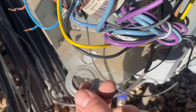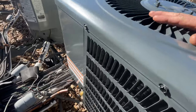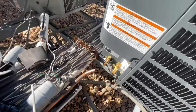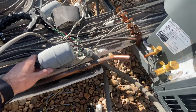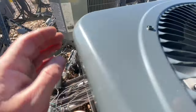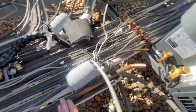Save these rings — they come in handy. Here's our drop-in condenser, this is a Goodman. I recommended replacing the compressor, but now look what we have to do: a bunch of retrofitting. The liquid line is not going to be a big deal because I've got to cut this filter out and replace it anyway. Actually, there's a filter in here already — I am going to cut this out and couple it.